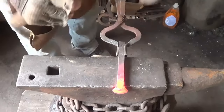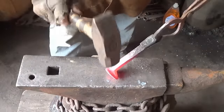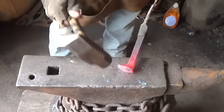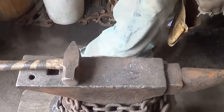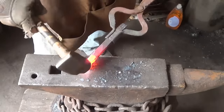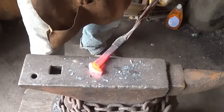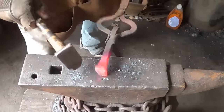Pretty much clueless as to what I want to do with this. Get that handle cleaned up a little bit anyway. We'll start rolling that edge just like I always do to bring it down - same thing with this side - just so we can bring her down without a rollover. I know we need a triangular shape. I'll put this down a little bit more. I'm going to get the fish mouth in a little bit there. We're going to want a squared end on this end, so I'm going to bring that back a little without rolling it too much. Bring that back - there's this bottom mass here. If we can bring that back without rolling it, I think we'll be in good shape.